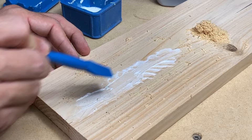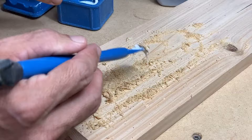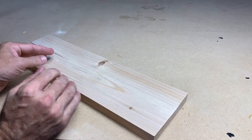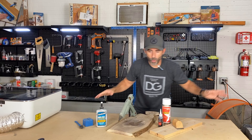After all, we are trying to stabilize the crack. Grab the remaining sawdust, spread it around, and push it hard into the crack. Let the glue cure for about a minute or two, then apply the sander again to clean off the excess. We stabilized another crack — looks pretty good. I probably could have used a little more glue and sawdust, but you get the trick and it works really well.